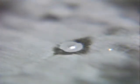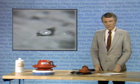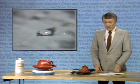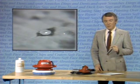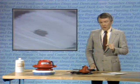Notice particularly the little round circles left in the paint around each of the dirt particles that has been scraped off. These circles, which we call barometers, are the indicators of how much paint is left on the surface. Circles like this show that the razor blade has just skimmed through the top layer of the paint. Learning to read and use these barometers is very important to being able to make these kinds of color finesse repairs. If you cut too deeply and eliminate them, you will not have a guide as to how much paint is left to work with when polishing out the area, and you may cut through to the primer. If that happens, you'll end up having to repaint after all, defeating the whole purpose of color finesse repairs. Learning to read and use the barometers is a matter of practice and experience.